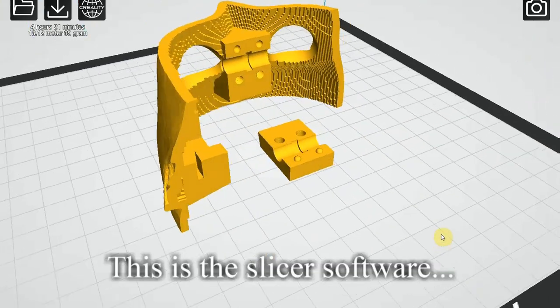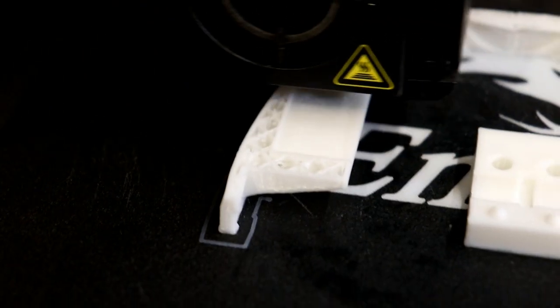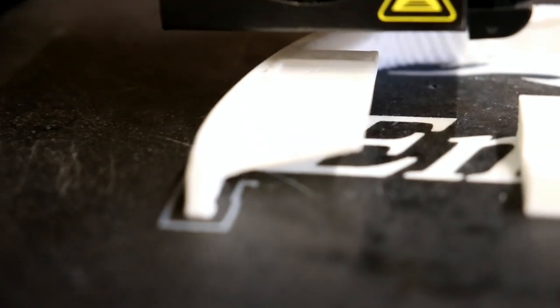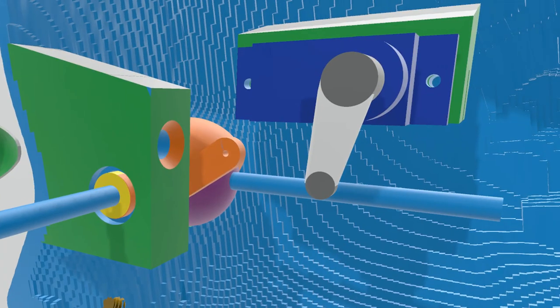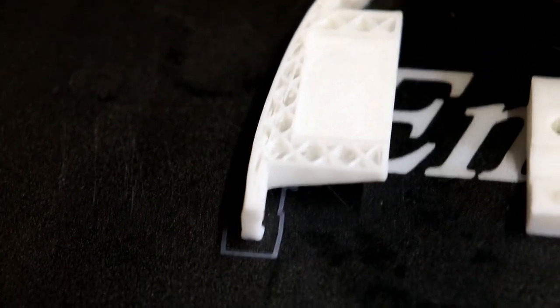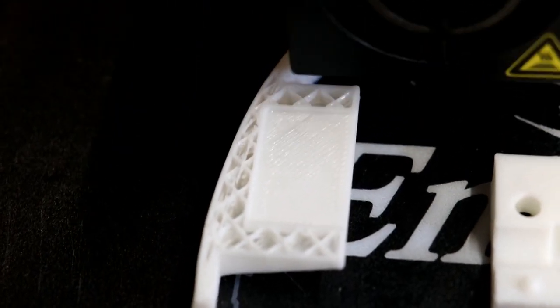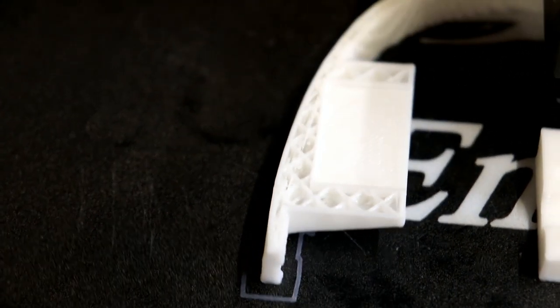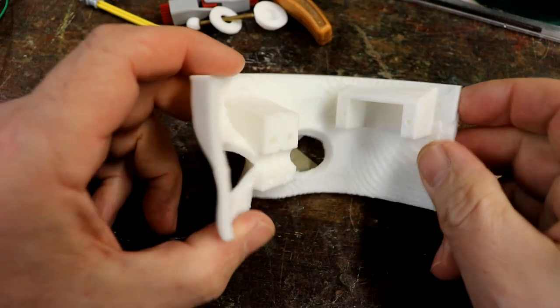I'm just printing the eyelid mechanism to test it. This is a very nice demonstration. Every time I start the camera, the printhead goes over. It's a very nice demonstration of how the 3D printer can print something that overhangs. What it's doing, as you can see, I've set this up to a 15 degree angle, and it's printing, as you can see, from the bottom up, obviously, and it's coped with that. And now this is going to hold the servo motor, and it's filling in all the surrounding bits, the middle if you like, with the cross parts, 20% set, and that flat bit there is going to be where the top holds the motor in place. So it's quite interesting to see how it completely combines these shapes, because they are separate shapes when I drew them in 3D Builder, and then you slice it up and it just turns it into one solid shape, which is very clever. Excellent. Well, this is all very exciting.